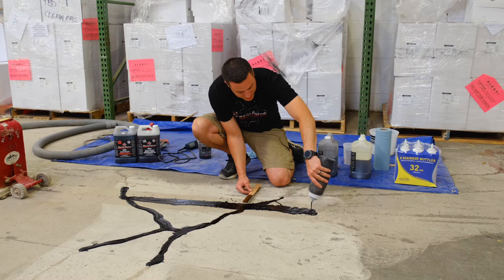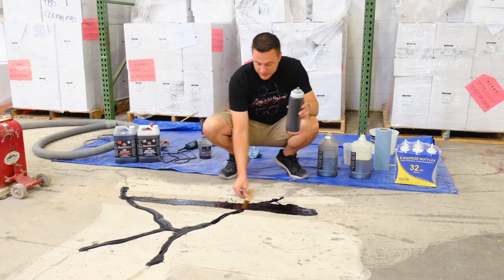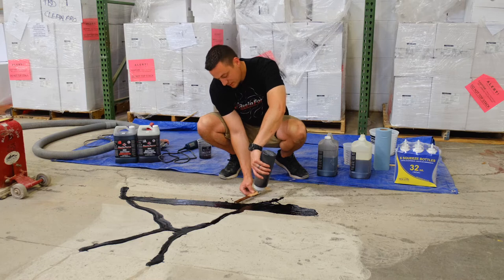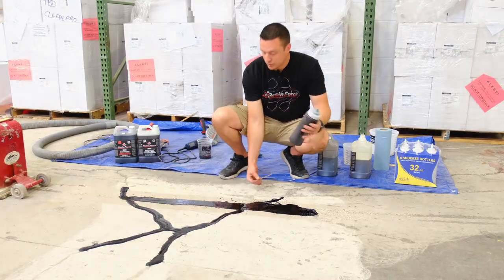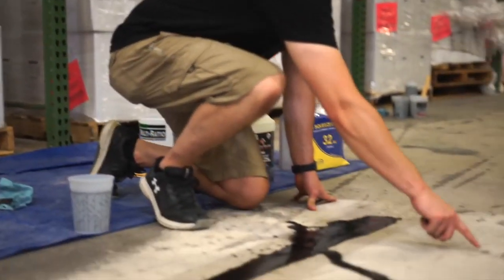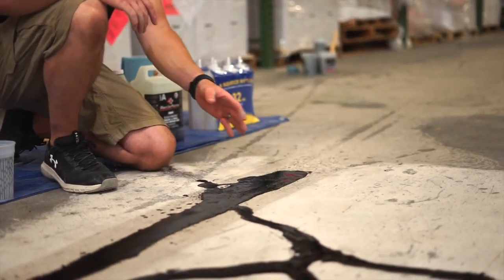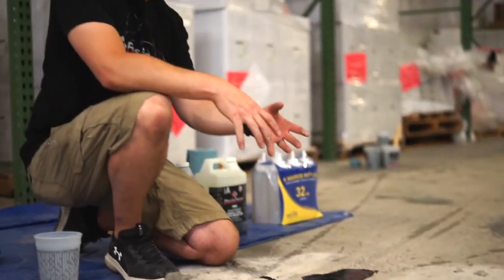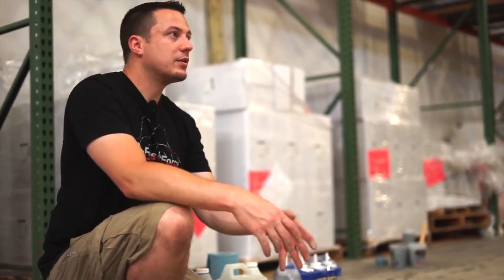See how runny that still is? Once we hit that six-minute mark, it's just going to snap — and you'll see that once this cures, in about 15 minutes it'll be ready to grind, maybe 20 at most. This will dry and cure gray. That works great for cracks and deep spalls. But when you have really shallow spalls — such as these little dimples here — for the really shallow spalls you do not want to use sand, because you want the liquid to be very low viscosity, to penetrate the pores of that miniature spall or dimple. That way when you go to re-grind it, it doesn't pop back out.